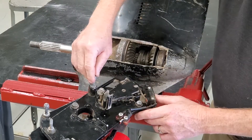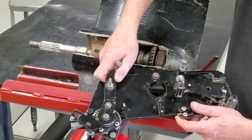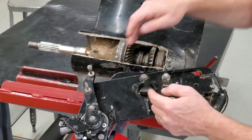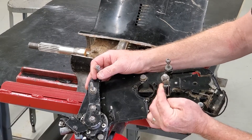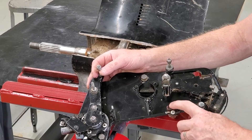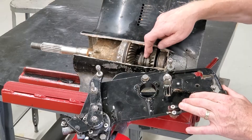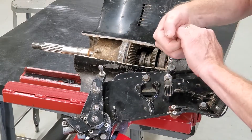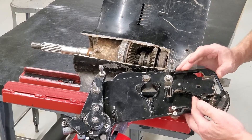But I'm trying to shift the drive, so I'm pulling on this cable — that pulling is trying to move this arm. When I try to pull the shift cable back, I'm trying to move this cable, but this is locked in place so the cable doesn't want to move. So as I try to pull that cable in, this cable flexes. It has a hinge point here — this is the shift cutout switch. That shift cutout switch is wired up to the negative side of the coil and then to ground. So I momentarily try to shift it out of gear, the clutch won't move, and as you move it, this grounds the ignition which slows the engine down. When it slows the engine down, you can shift it out of gear. So that little click sound every time you shift an alpha drive is this mechanism making that sound.